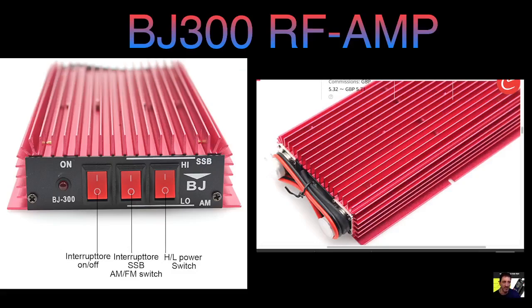M0FXB, welcome to my channel. I was looking for a budget amplifier that I could use for SSB only. I only plan to put about half a watt into this amplifier because I only want to get 30 or 40 watts coming out of a QRP radio that I've got on SSB. I'm not interested in using it in AM mode or as a CB type amplifier — I just want some extra watts when I'm using my 3 watt radio on SSB.